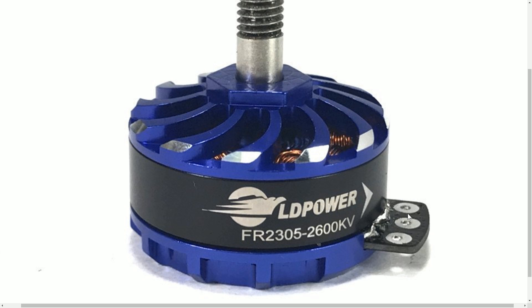These motors come with solder-on tabs for the motor wires instead of traditional motor wires, and people have a love-hate relationship with these. For somebody like me who moves motors around a lot or constantly swaps motors, this was really nice — especially because sometimes I'll solder a motor to an ESC on the arm of the copter and later want to move it or swap to a four-in-one ESC. Once you've cut motor wires you're kind of committed. This gives you the option to easily change the motor wires without eventually cutting them so short the motor's no good anymore. On the other hand, if you just put the motor on the copter and hardly ever change it, this may not be a benefit — it's actually a little more work because you have to make two solder joints instead of one and cut the wires to the right length.